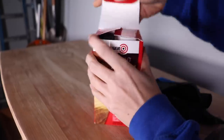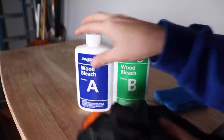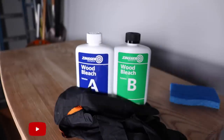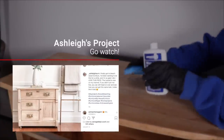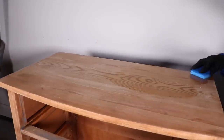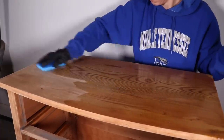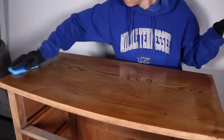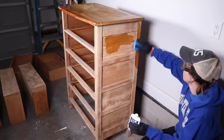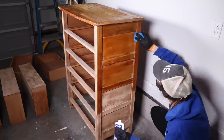Instead of paint or stain today, I'm just going to be bleaching my wood to get a natural look. I bought this Zinsser wood bleach a while ago off Amazon — it goes in and out of stock — and I've been waiting for the perfect project to try it out. My friend Ashley Lauren on YouTube recently did a piece with this and it was gorgeous. To start, I'm putting on the A solution first, applying it with a clean sponge. I have nitrile gloves and goggles on so I don't get any bleach on me.